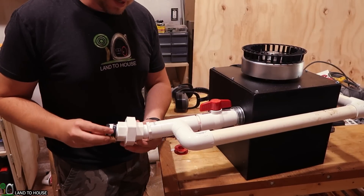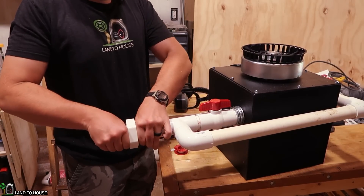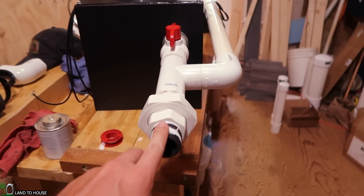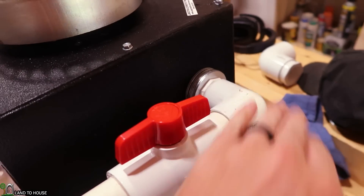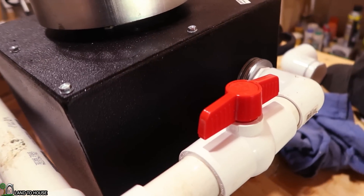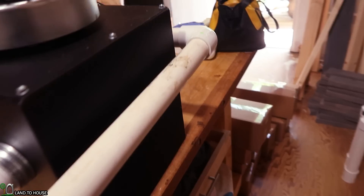I have everything plumbed up. Last thing is to put this union on here to make it easy to remove the penstock if we need to access some stuff later. It's just an inch and a quarter. Let me walk you through what I came up with. The penstock will attach to this right here and water will go straight through to that 3/16ths jet that's in there, and then it will have the option to skirt over here, come down, make all these 90s and go into the other side. Hopefully this doesn't slow stuff down too bad, but at least it will give us the options to use both sides. We can just shut off ball valves whenever we don't need a jet. So hopefully we'll have enough water for this one all the time and then sometimes we'll be able to use this one.